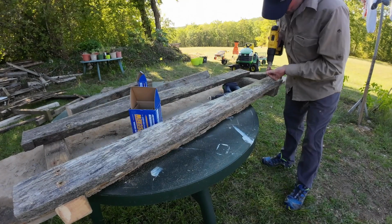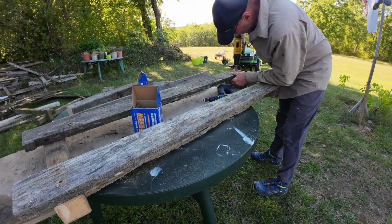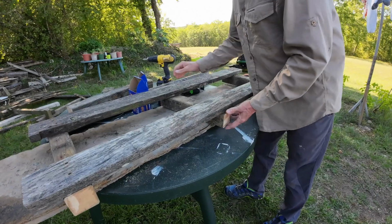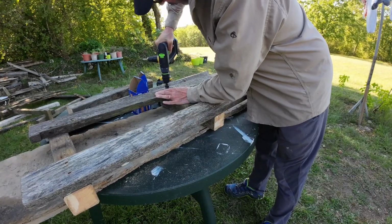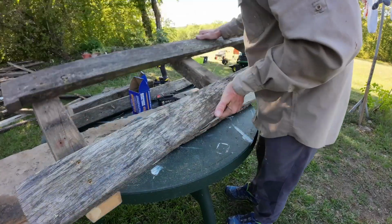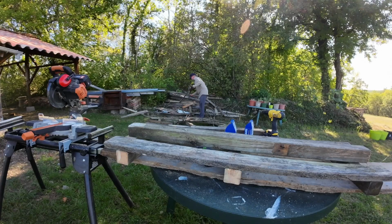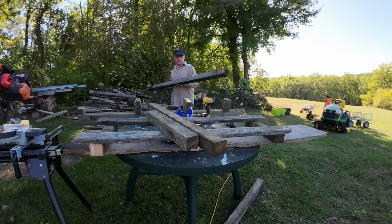The first thing I needed to do was make a base, and for this I used 3 pieces of 3x3 and 2 pieces of the 1x4 oak. I'm making this base 16 inch wide because that is the maximum log size I can store and get in my wood burner. In essence, I've made a pallet.